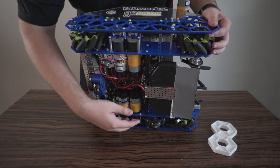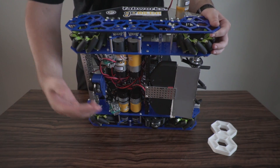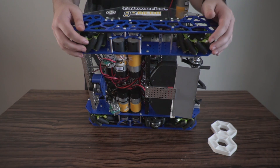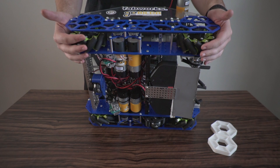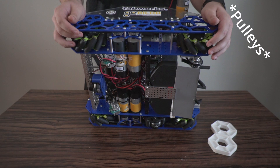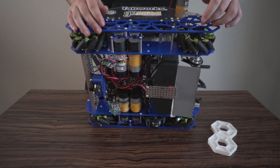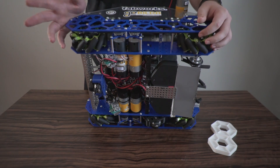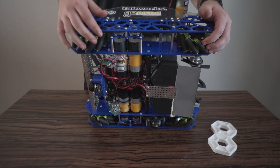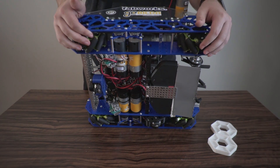We also added odometry modules inside the drivetrain, which allow for really precise robot tracking. You can find more about this on the FTC Discord or by looking for Open Odo, Luni Odo, or similar. We're using Gobilda Mecanum wheels with custom painted panels and 3D printed belts. The drive motors are 13.7:1, geared through a 16-tooth to 19-tooth reduction, which comes out to about 16.4 effective gear ratio. We're happy with this, but teams may want to consider a higher RPM ratio for the longer sprints in this game.